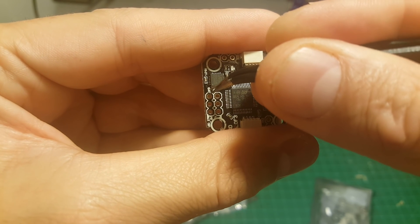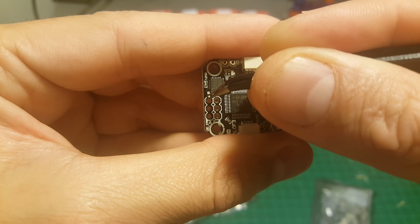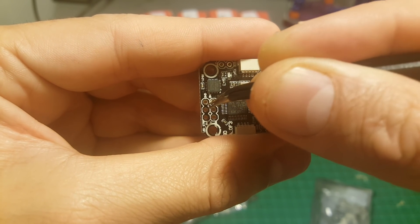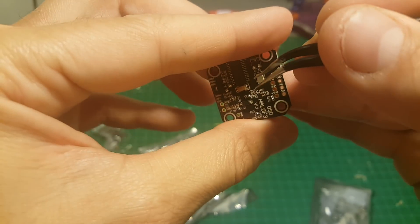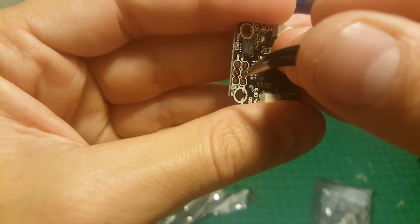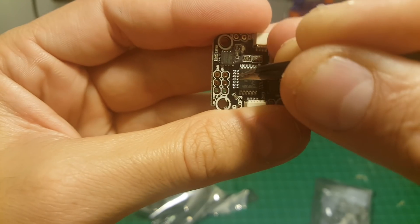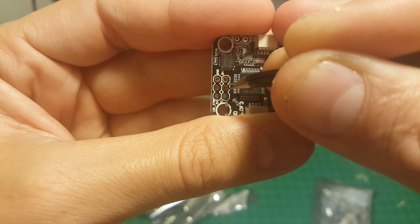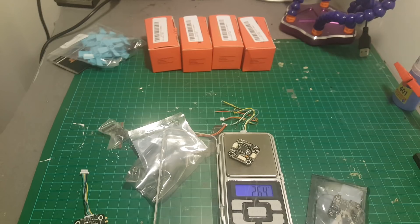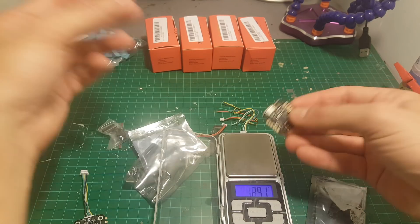On the left we can find the LED controller pads: two grounds, 5 volts, and either 3.3 or 5 volts depending on the boot pads you soldered on the back. There is also the LED signal and the RC in. Basically the top plate — your receiver — is going to be connected using these three pads.